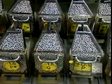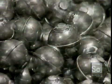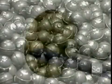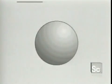Elsewhere in the plant, they classify the steel balls according to size. These balls started out as steel wire — a machine cut them into pieces and a die punched them into rough balls. Those rough balls go into a grinder which removes the bumps, then other machines round them out and give them a mirror finish.